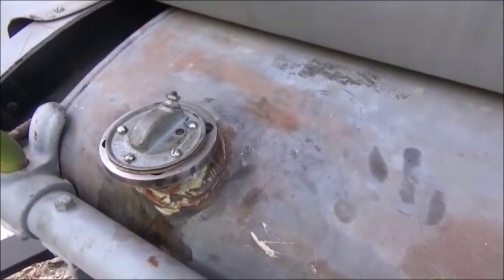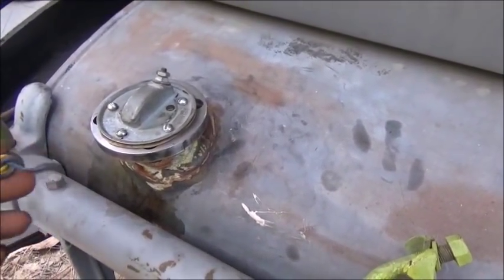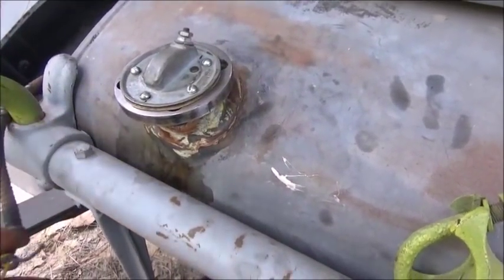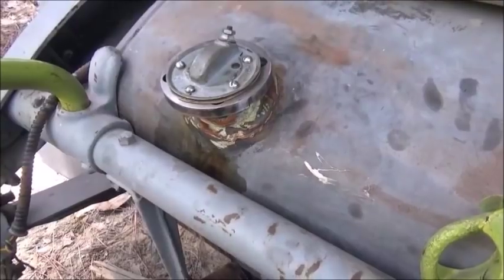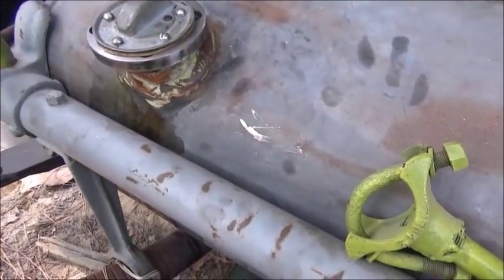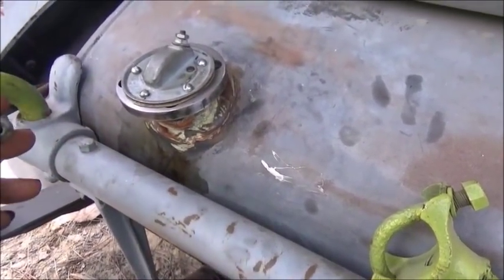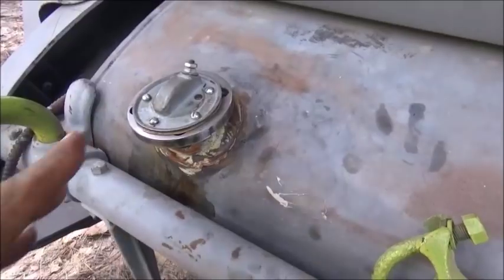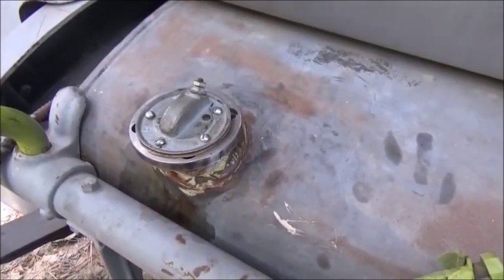This is possibly temporary - it might stay there a while. But it's supposed to have power on one side and negative on the other. The blue is the power wire, yellow is negative - why they did that I don't know. It's not supposed to be power all the time, which it is, so they just happen to wired it wrong. Not a big issue. What I'm probably going to do is cut the blue one back, figure out a way to hook the yellow ground up to it just for looks, and call it quits on the gauge for now.